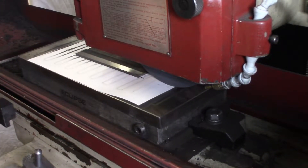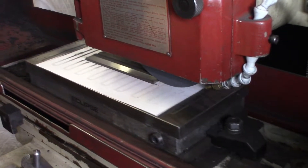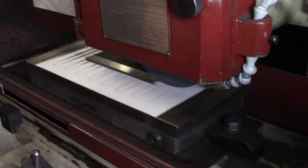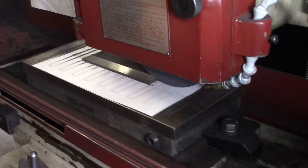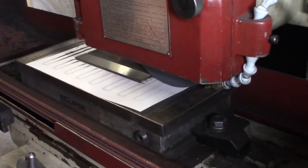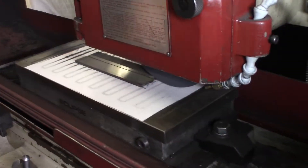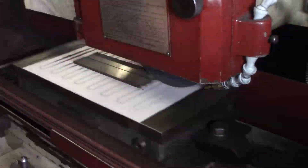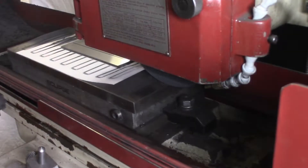This process is pretty self-explanatory. It's going to go back and forth, and then eventually I'm going to get it to the same thickness. Then I'm going to flip these two files over and surface grind the other side. I expected quite a bit more stone wear because I was grinding a file with a weird abrasive surface, but I really didn't notice anything different than normal surface grinding. If I had it turned around in the other direction, it would have been a problem.